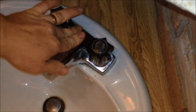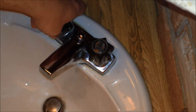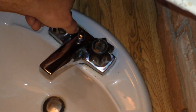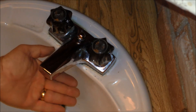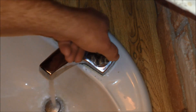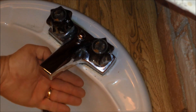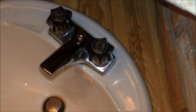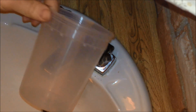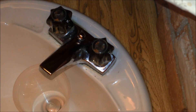I'm going to turn this to where the handle is parallel with the pipe — that means the water can flow through that valve. Now that the water is turned on, we'll open the drain and turn the water on. We'll start with the hot water, turn it off, and it does not appear to drip. We'll do the same with the cold water — and that does not appear to drip either. So I'm going to call this fixed. To test it for sure, I'm going to place a high-tech one-quart Chinese food soup container underneath this and see if it collects any drips overnight.